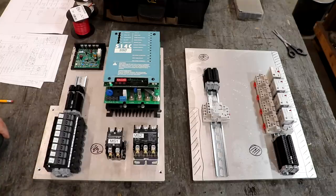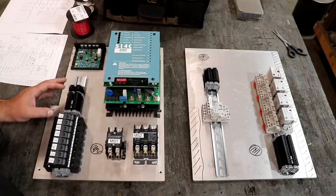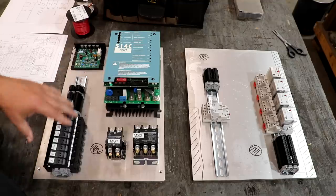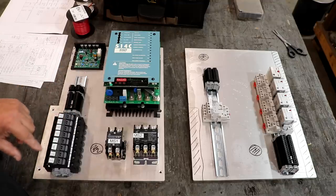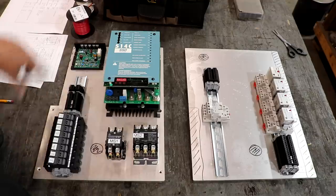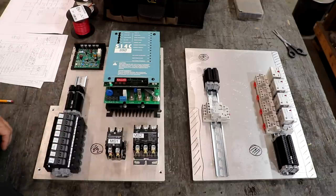And there is a control transformer on the back of the lathe that we'll also be using to take the 220 volts down to 110 volts to do some of the control stuff on here. And there's also a fuse disconnect mounted to the lathe that the power will be coming through to power all this stuff. So there you go.